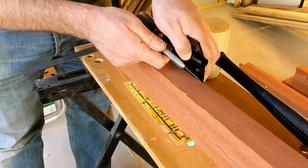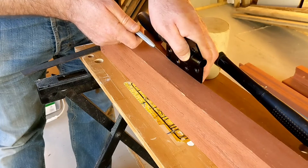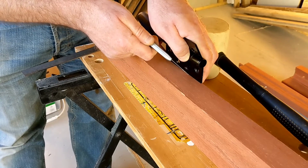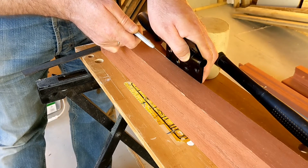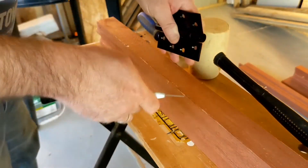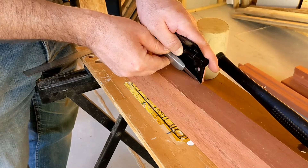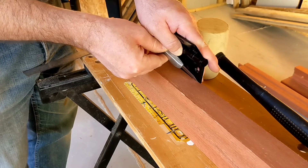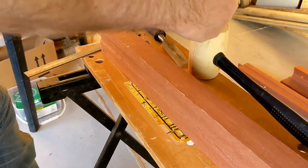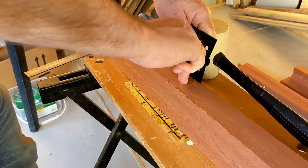Be careful you're not just following the grain — try and follow the actual hinge, not jump off into the grain like it wants to do. Just get that marked on, even if it's just lightly at each end at least. Then use a steel rule in place and run along — just make sure that's in the right place.